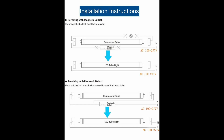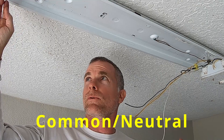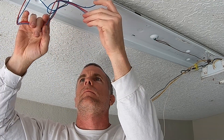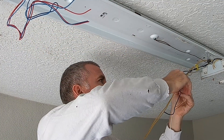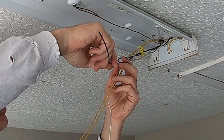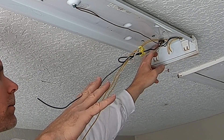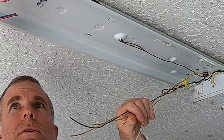These are the instructions we're going to be following — we have the double-end LED bulbs and the electric ballast bypass instructions. From here you've got to figure out what side you're going to use for power and what side for ground. I left a lot of length on these wires so I can run across. Right now I have this black wire — it was feeding power to both sides. I'm going to take this wire out and run the yellow wires onto one side and the black wires here, leaving these as hot.